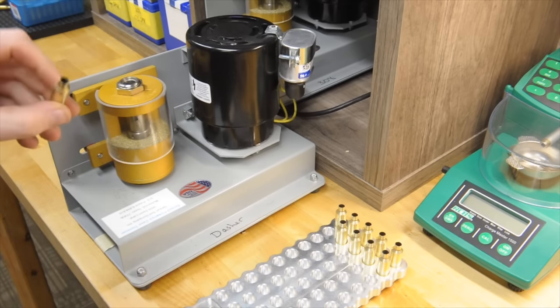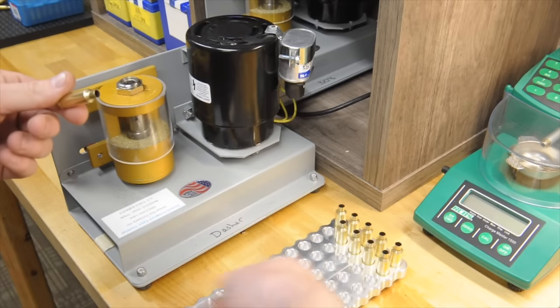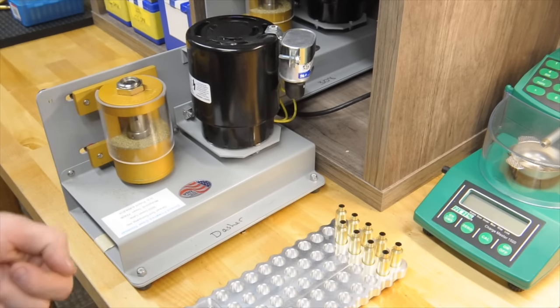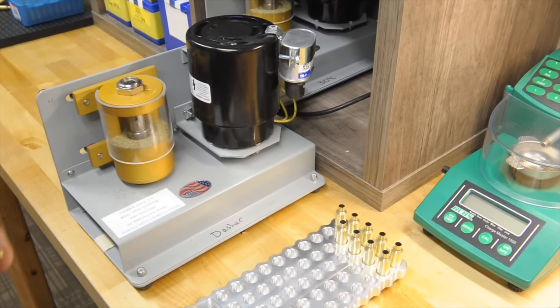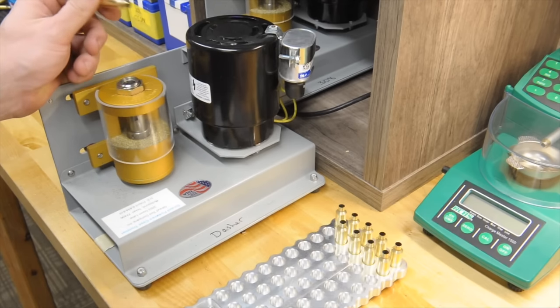So I'm going to turn this on and show you what it's like real quick. This is an optional tool — I think they're about $500 to $550. You do need to trim your brass — normally every couple of firings you can get away with not trimming it. I like to do it every time just for that nice chamfer. You can buy a Lee hand trimmer, Henderson has one that's a really nice setup but you have to hook a drill up to it. I can do 100 pieces in about 8 minutes with this one.